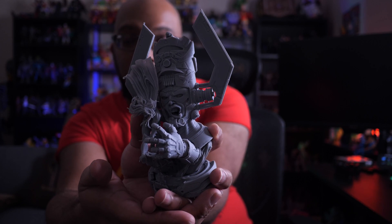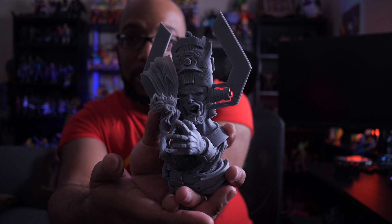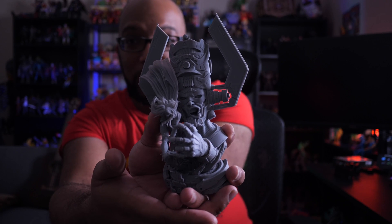You just saw the heater in action — now let me show you what I printed with it on. This is a Thor versus Galactus statue from Wicked and it's almost done. There are a few small parts I still have to print, but this is roughly what it's going to look like if you choose to print it yourself. My experience with that resin was pretty good — didn't have any major problems. Was able to scrape it off the build plate easily in one piece, the supports came off pretty easily as well. I had a normal layer exposure time of about 2.1 seconds and a bottom layer exposure time of about 35 seconds. It just worked out — it's a pretty good resin.